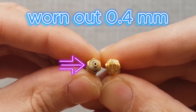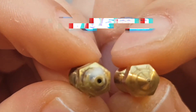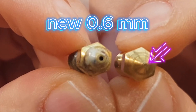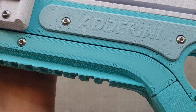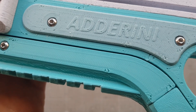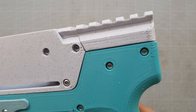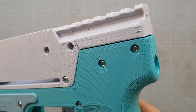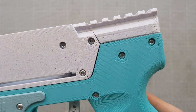Here is a closeup of my old 0.4 standard nozzle, and on the right side is the new one with a diameter of 0.6. I should definitely have changed the old nozzle earlier — I'm surprised that the printing results were still, well, reasonably okay. Towards the end, the under extrusion became more and more prominent, so it's definitely time to replace it with a new one.